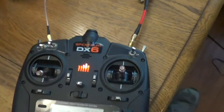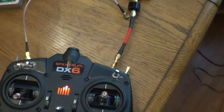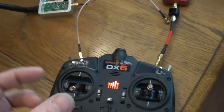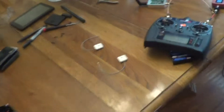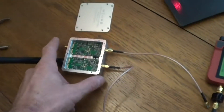The idea is you do vertical and horizontal polarization — it's called MIMO: multiple input, multiple output. But this one is just multiple output. I'm going to be taking up the power. I want to get the range up on the little tiny receivers, which are the tiny whoops. I'm going to try to get the range out to a mile on those, which would be the limit of what I'd want to fly.